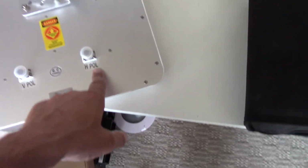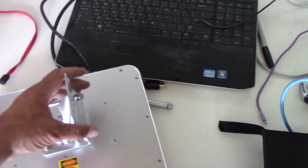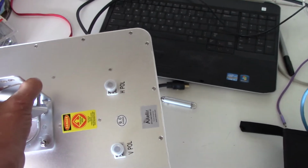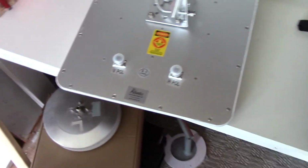So you may have seen, but turn the camera around again, underneath my network kit, which I'll just close over here, is an antenna. This is just a standard 2 and 5 gig hybrid antenna. It's capable of vertical polarity or horizontal polarity, and that's basically, is it going to get the waves this way or this way? And in this case, instead of rotating the dish like we used to do in the old days, it's just got a grid for both in there, so it's easy.